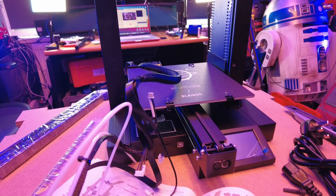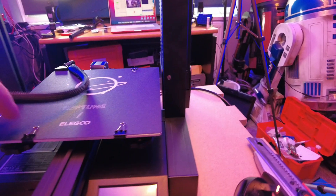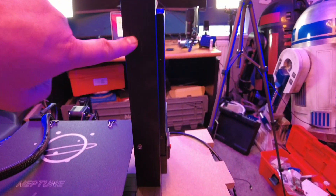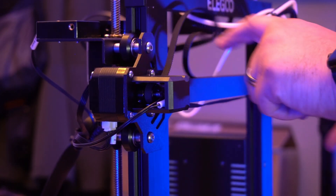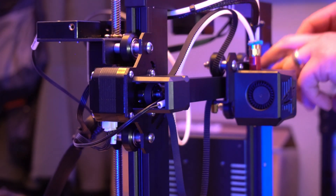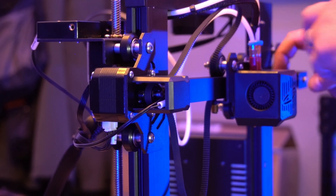So this printer came in at a pretty good price of £200 or $270. The unboxing was actually pretty simple, most exactly the same as the Neptune 2 with a couple of added extras, and it's everything that you would tend to find on many budget printers. You need to partly assemble the printer. And right away, in the background of my mind, I had reservations about the hot end setup, mainly due to heat creep and blockages, which are prevalent on the Mark 8 and Mark 10 style hot ends. This was either due to the heat penetrating the heat break or fibres blocking the nozzle. There are parts on these printers that need attention each time you start and end a 3D print, and you'll need to do this in order to avoid fails, wasted filaments, and time.